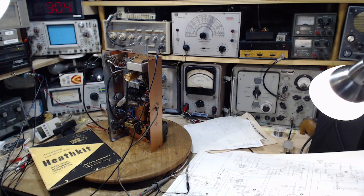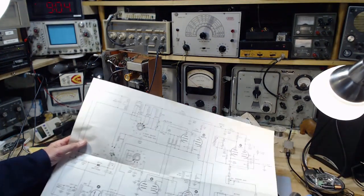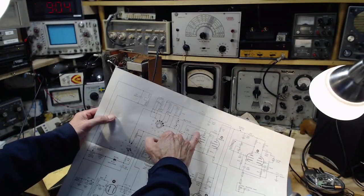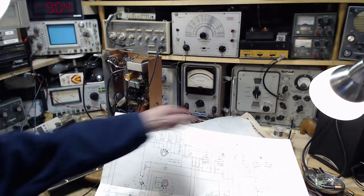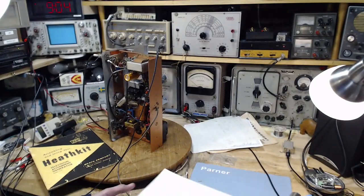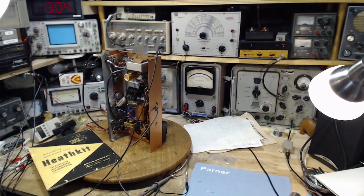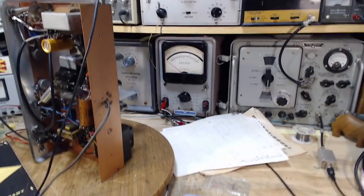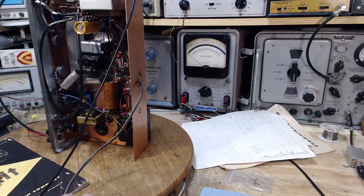generator. What I mean by that is I take my ohm meter, I take a look at the schematic, and say to myself, well, if you can test between pin 6 here and pin 7 there, you should read this resistor, 100K. And I just go through every kind of combination I can come up with, looking for an anomaly. I spent a long time doing that. No anomaly. Every reading I took made sense. I didn't find anything at all.